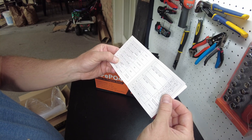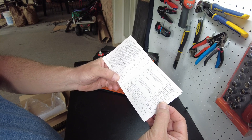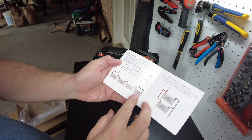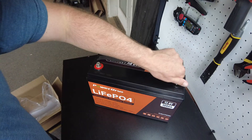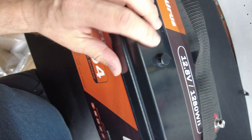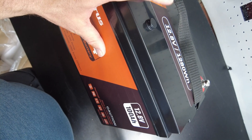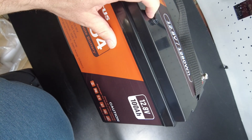You can continuously charge it at 50 amps, and continuously discharge at 100 amps. It says charging protection temperature is 0 degrees Celsius or 32 Fahrenheit, so maybe that's implying it does have low temperature protection — we will test that. You can put four in series, two in parallel, and there's a series-parallel configuration. Looks like we have your standard M8 terminals.